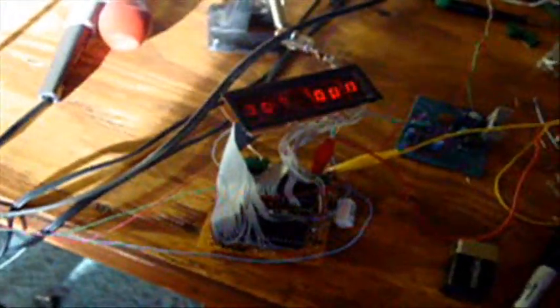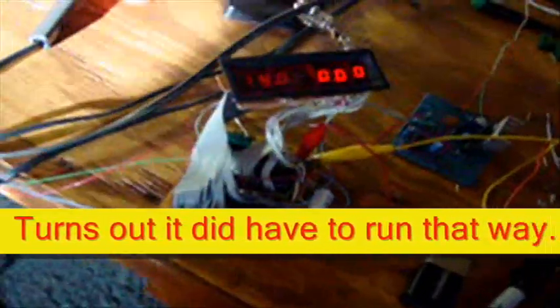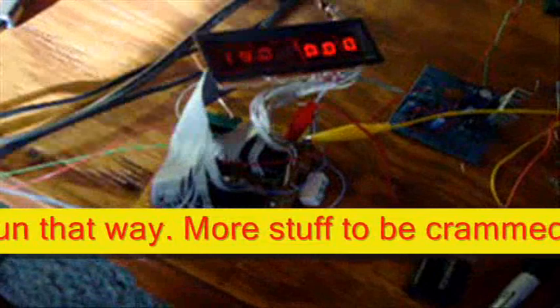This is the first volt and amp meter module. I was wanting to run all the meters off of one power supply, but unfortunately that's not going to work. I probably have to have one power supply per meter. That means the voltmeter is off one, the ammeter is off another, then the other voltmeter is off a third, the other ammeter is off a fourth. I tried running the volt and ammeter off together, but they interfered. I had problems. Have a voltmeter and an ammeter running off separate power supplies.